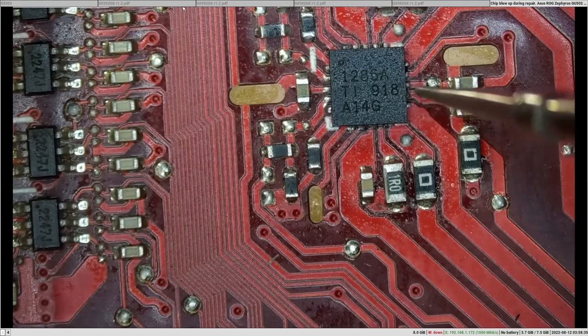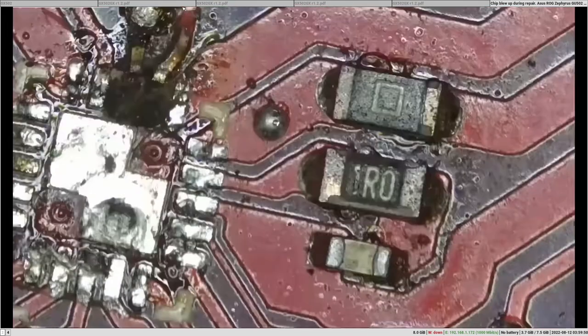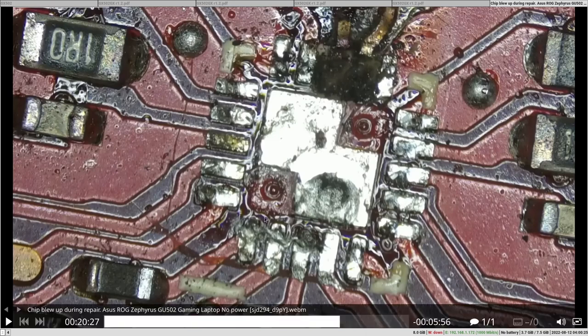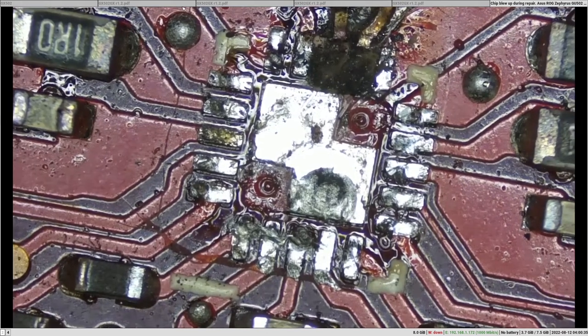The probe didn't touch the adjacent pins, but at this point the chip burnt anyway. When he checks VIN — which is 19V — right next to another pin, it's very easy to accidentally bridge those and burn the chip or a capacitor. So if he closes in and the probe gets right between those two pins, that's a real risk. The chip burned regardless — possibly just unlucky.